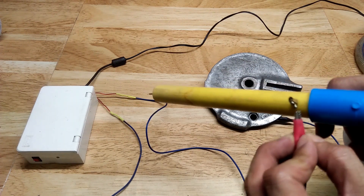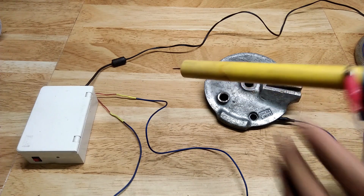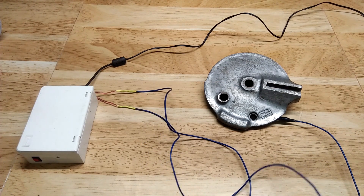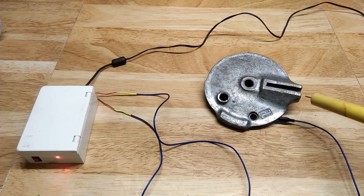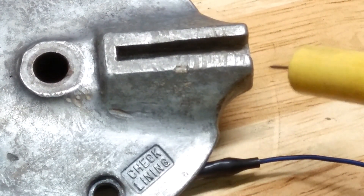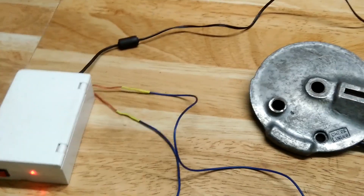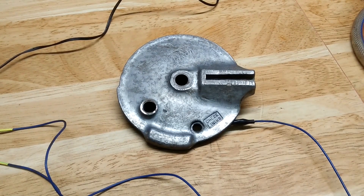So that is how my new powder container will look like. Now let's try if this setup works. I connect the positive clip to the central conductor terminal and the negative clip already attached to the piece I want to powder coat. I turn on the power supply and you can see the spark jumps from the central conductor, telling me that high voltage is present. Be sure to see my video on how I made the power supply if you have not done so yet. I turn on the blower and let's start blowing some powder.